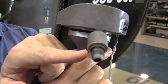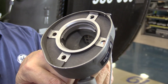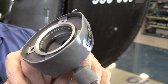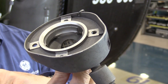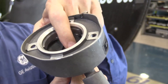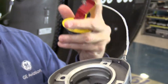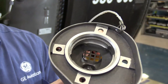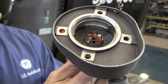When you service this, it is a fill-to-spill system. There is a drain line on the other side that goes to just at the bottom of the fan case. You don't want to be too sloppy with that, because it will accumulate oil in the bottom of the fan case, creating a messy situation. Do not put anything in here to defeat that system, and be careful to pour in the oil slowly.